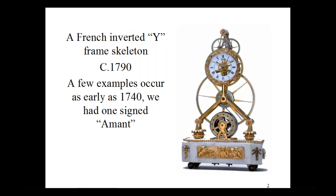Here we have an early French skeleton clock, inverted Y, circa 1790. We've seen this style clock as early as 1738. The spring barrel is attached to the base, and then the frame itself is attached separately to the base. The power travels up from the spring barrel to the fusee. The frames are held to the pillars by cast brass rosettes, threaded with a die so that they thread into the pillar. Most of these French skeleton clocks are pinwheels, and you can see the arms of the verge down the side. The bases are often adorned with friezes, castings, or other gilt ornamentation.